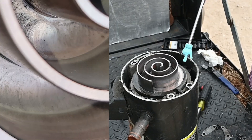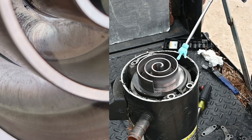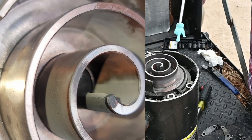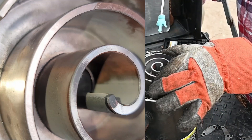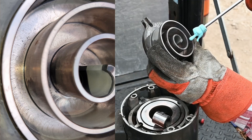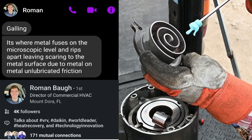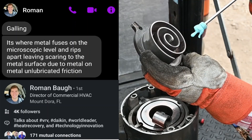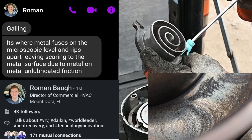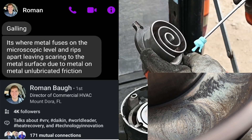If we look at the orbital scroll — this is the part that moves — we see more signs of galling through these circles. That's from compressor overheat. I see this sometimes in compressors that are only a year old. The actual scroll set itself is in very good condition. There is a little bit of carbon built up there, also consistent with compressor overheat. When that compressor gets so hot it has loss of lubricity — the oil doesn't lubricate anymore, the metal will actually fuse itself together and then rip itself back apart, and as the scroll action continues it makes these little circles.